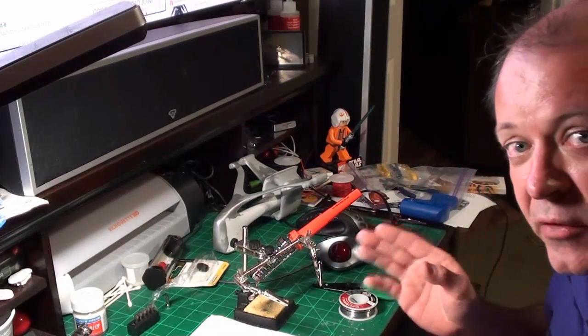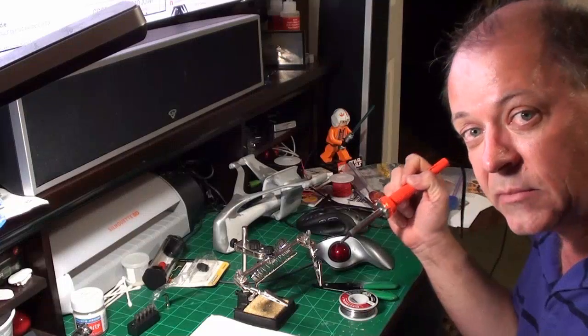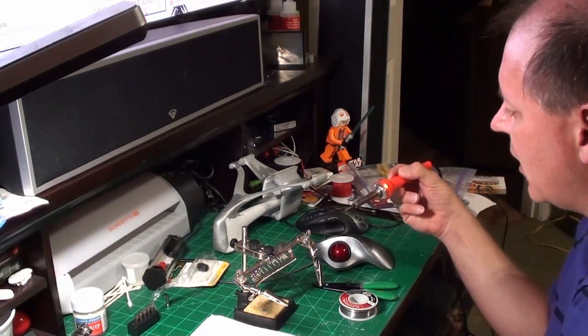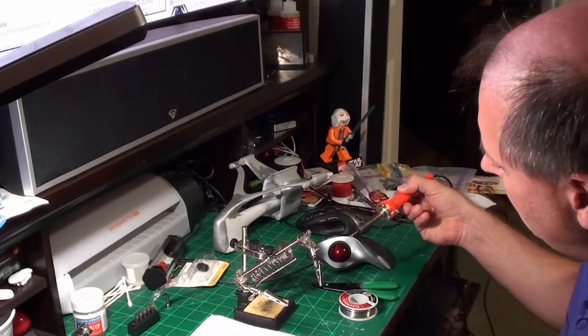This is a fairly new tip, and the first thing you do with a new tip is clean it. You want everything clean when you're working with your soldering iron — that's why you want a damp sponge. The contact between the water and the soldering tip helps clean it, and you really can't touch that with your hands.